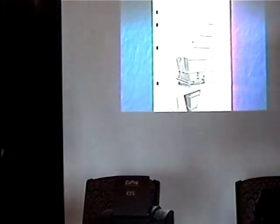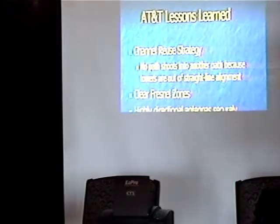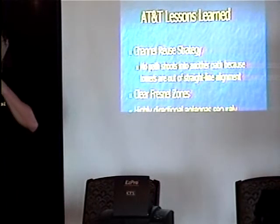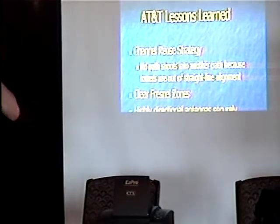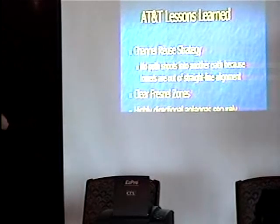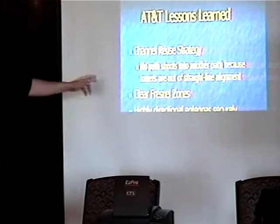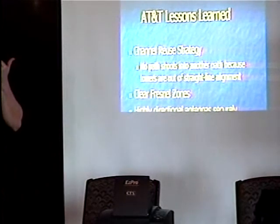Another fact: the AT&T cornucopia antenna has a wind profile of 67 square feet, which is extremely large. Most small antennas, a 23 dB dish or so, you're going to wind up with about 2.3 square feet or less. So you can see why they had to have such big towers. The original AT&T microwave stuff used highly directional antennas, securely mounted — they were transmitting less than five watts but had a lot of antenna gain behind it. Their channel reuse strategy was very important: no path shoots into another path because all the towers are misaligned with each other, so it's not possible to shoot into another tower at all — they intentionally offset everything for this reason.